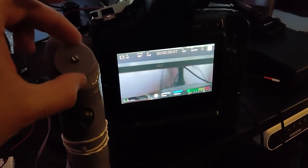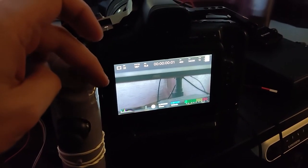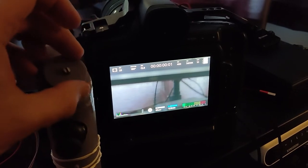In the early stages, I bought some previous ones that would constantly crash when uploading code. It would constantly clear out the memory cache. It would lose the bootloader. So I did a lot of problem solving in terms of flashing the bootloader, reloading the thing, trying to recover broken ones. It was just not very friendly. But in essence, we got this done, and we connected it up to controllers, and we managed to get the ESP32 working with a Blackmagic camera via Bluetooth. And it worked pretty well. It worked. Right, that's the most important thing.